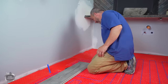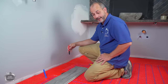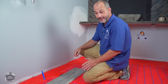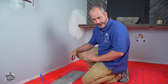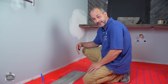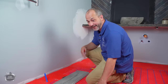Now, traditionally, this kind of flooring is what I would call a beginner level installation because it's just measure and cut, right? All you have to do is mark and go ahead and install it. Vinyl flooring does not expand with heat and humidity. I'm so tired of hearing that all over the industry, and this is going to be contentious because when it first came out, the advice was just tell everybody when they ask about it to treat it like laminate flooring, but it isn't like laminate flooring. The reality is this product has an expansion of something ridiculous like less than 0.5%. So in my world, that's a zero expansion, because I don't have temperature fluctuations that are gonna cause that to happen. Even though I'm heating the floor, I'm not worried about this buckling.